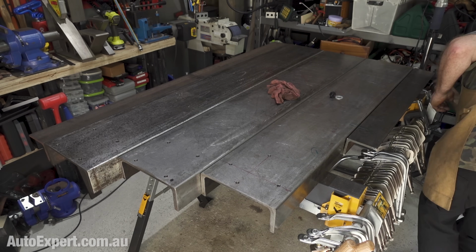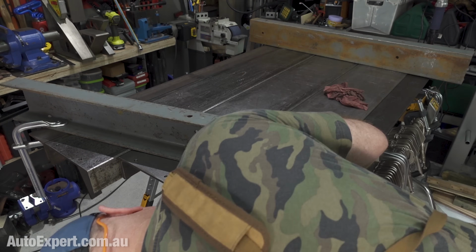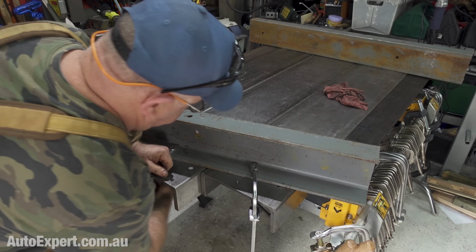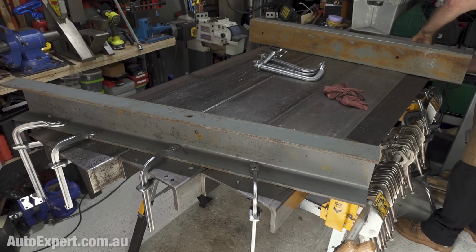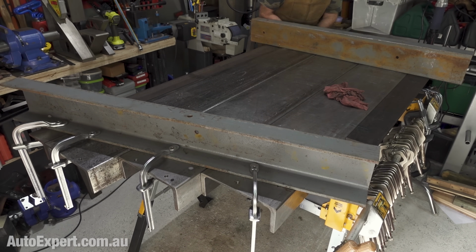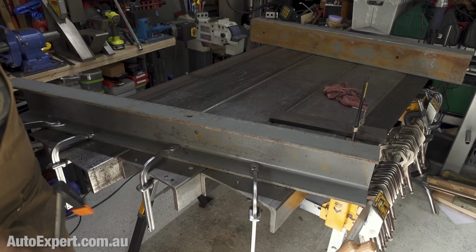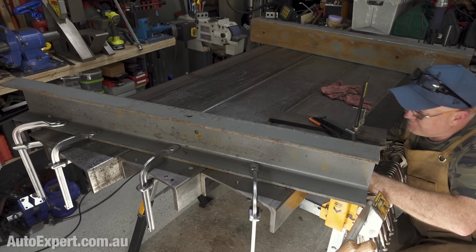If the mu of steel on steel, the coefficient of friction of steel on steel, is 0.2, then that's about 6 tons worth of shear load either way to disturb the orientation of this joint. And that's what high tensile fasteners are all about. If you use the proper fasteners, it makes the job really easy and it gives you the result you want.